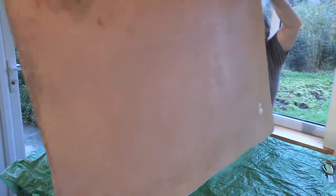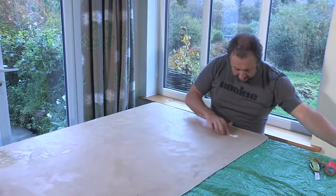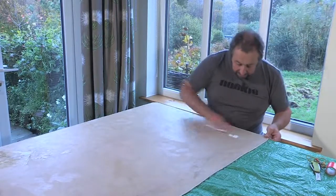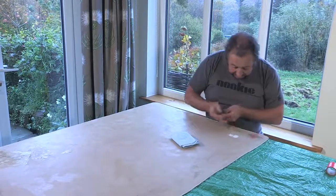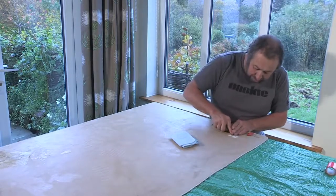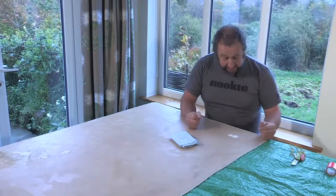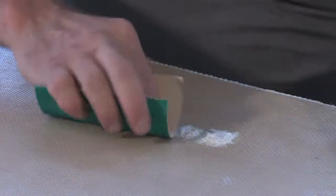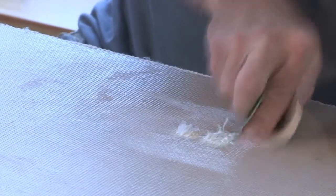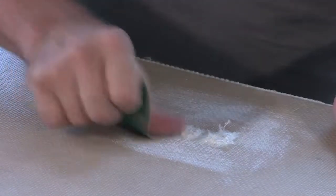Now we're on the inside of the laminate. We're going to make sure again this area is clean and dry - you might need to do this with a stove. Check for any loose fibres or anything that's going to get in our way. That's not too bad with that type of puncture wound. So we've now prepared the area and it's ready for some laminate to go on top to make it watertight. To give the area a key and help the resin bond, I'm going to sand the area with the sandpaper, in and around the area and beyond where the fibreglass cloth is going to go.